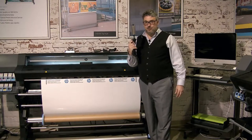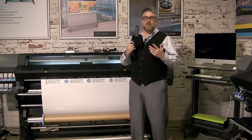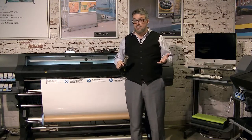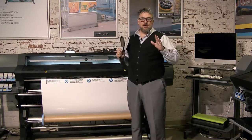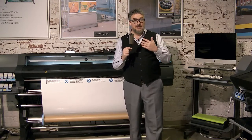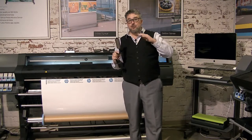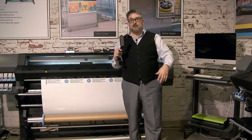This may be in the box in your printer someplace and you didn't know what they were for. There are instructions in there on how to install them. If the instructions have been lost, reach out to HP — I'm sure we have some very basic directions on how to put these together. If you have an older latex printer, these are available to you if it's a 300 series or better, and you can order these and have them attached to the end of the dancer bar. Keep in mind the adjustment happens through the threading, so you want to make sure they're exactly the same distance on both sides. When you have certain materials that need more tension like fabric, you're going to have to remember to slide these back down again. Otherwise, you're going to have too little tension from the dancer bar and fabric will not travel well.